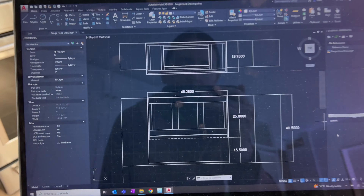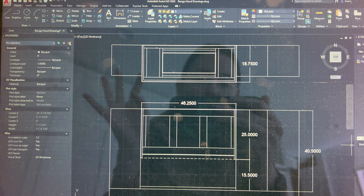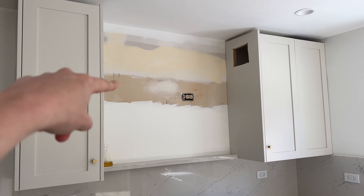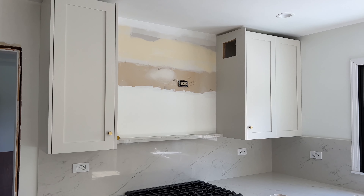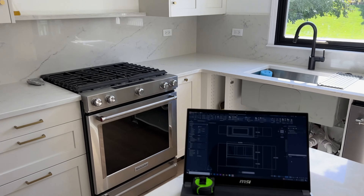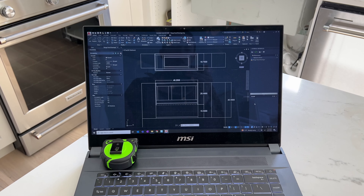I've got my drawing here. I kind of mapped everything out in elevation and in plan so we could figure out the overall dimensions and go from there. We're going to have a four-foot wide by two-foot tall range hood — it's oversized from our actual mechanical vent, so we had to figure out the additional framing for that. That's part of the reason why I made the decision to pre-plan it, which I don't usually do.